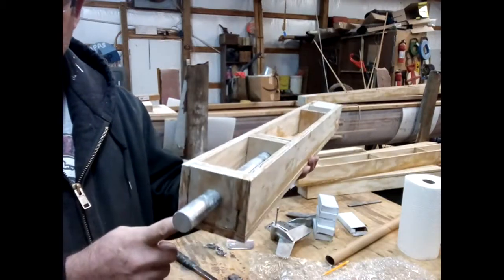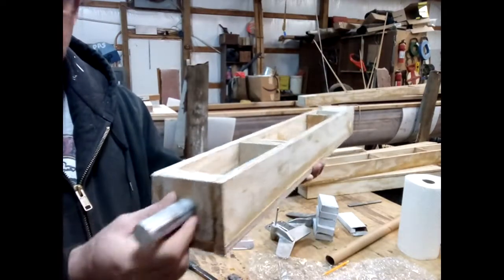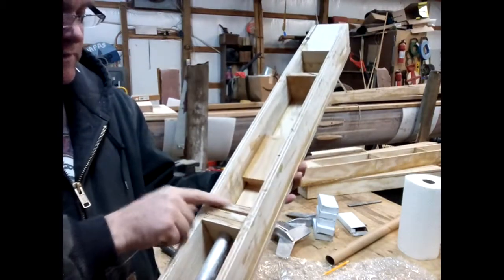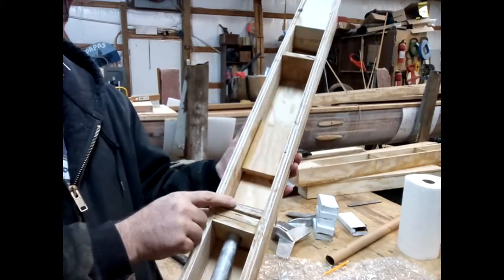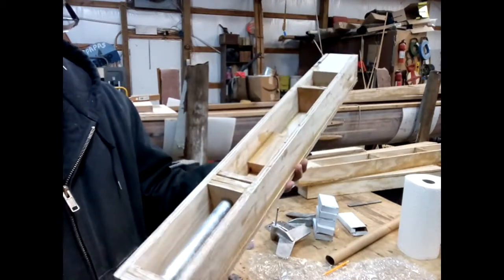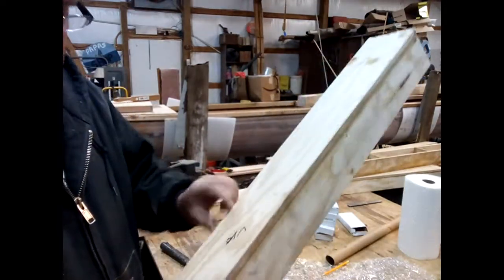I'm actually quite proud of my CNC machine. His name's Kong, who made these 1 inch holes exactly 1 inch, and I was able to slip everything on just perfectly. So I'm really happy with that. This is the outer bulkhead. You'll see me flare the end of this, and it actually presses against this spacer here, so it can't go in. It has to pull through here. It can't go out. And this actually transfers the load from here to here, so that'll be good. There's actually going to be a cleat on this side. I've got it marked as up.